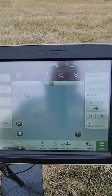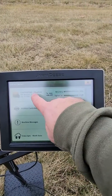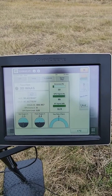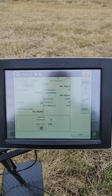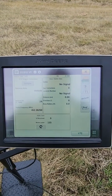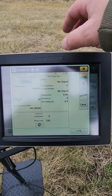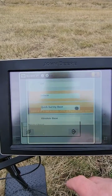On the display over here to get this thing set up, go up to the top like we're used to and hit 3000. This is the main page everybody's used to seeing in their equipment. You hit your tripod over here — this will bring you into the RTK network configuration. Right now it's in vehicles, so it could go in a tractor, combine, something along that line.